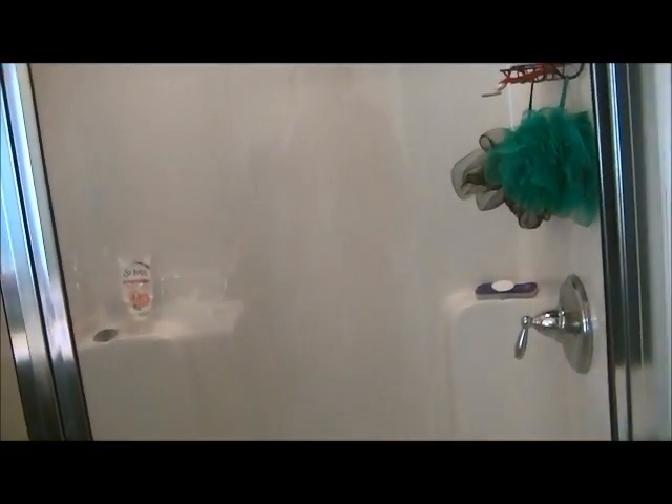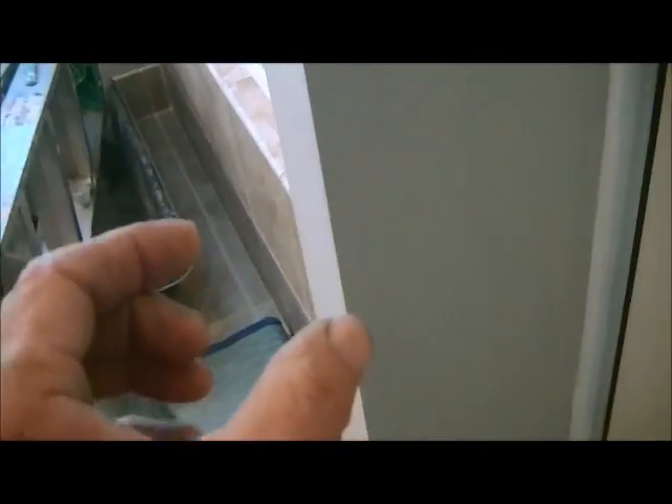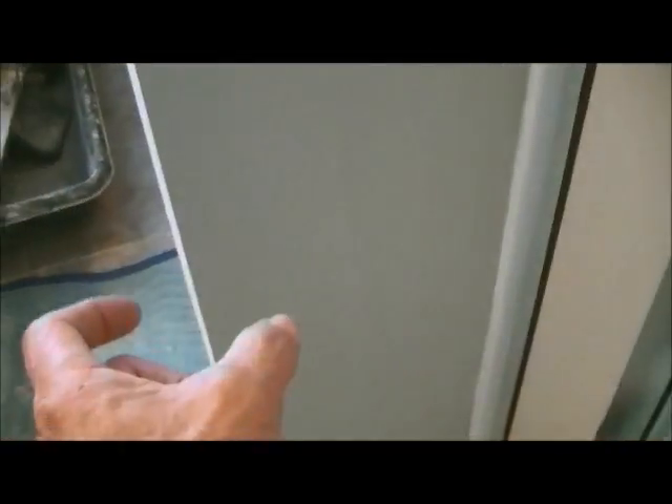The shower footprint stays basically the same, just a little more depth. It's going to be 12x12 travertine tile in a light color, with a 2x2 darker travertine-type tile on the floor. On the back wall there's going to be a niche, framed out, with the 2x2 tile on the inside. We're also going to use a 2x4 dark travertine-type tile to match the floor as a kind of wainscoting going around the walls.